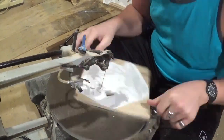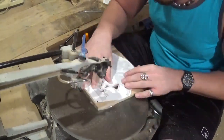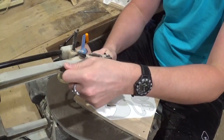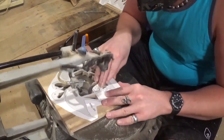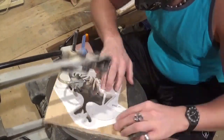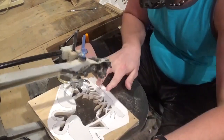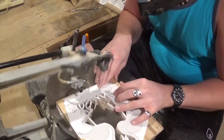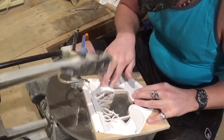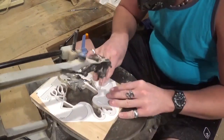As with most projects, I am stack cutting this since it's quarter inch plywood to get two projects at one time. Obviously I won't be able to stack cut the base — that'll be something I cut out at a later time since we're only going to finish one project in this video. Just going through here getting all the internal cuts, and the grass can be tedious there at the flamingo's feet — just take your time with it — being careful to cut out the tab exactly where it will go into the base, and beginning the final long outside cuts on all the pieces.